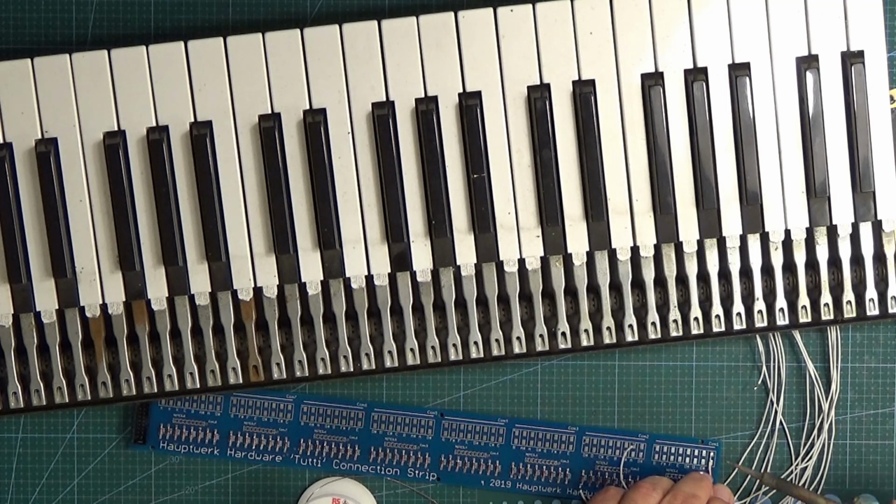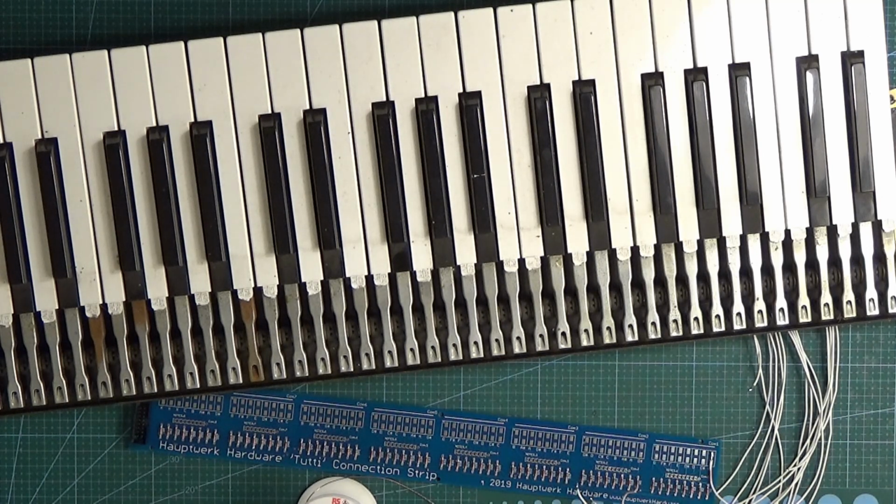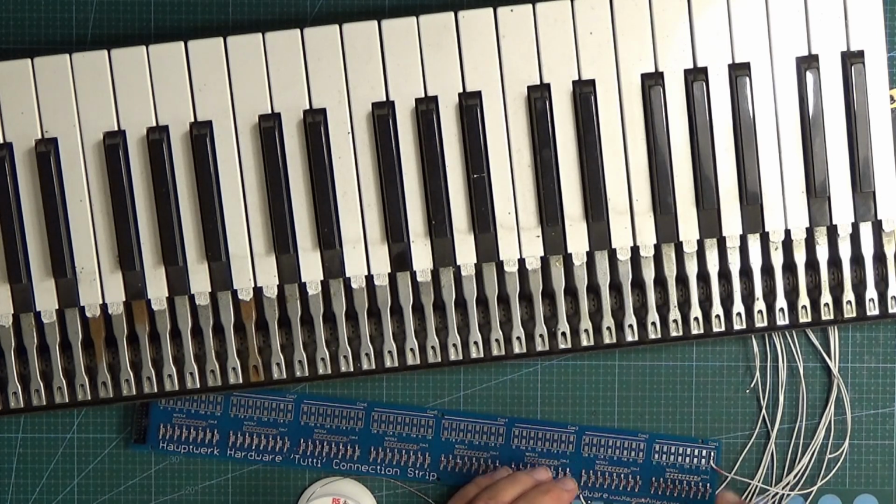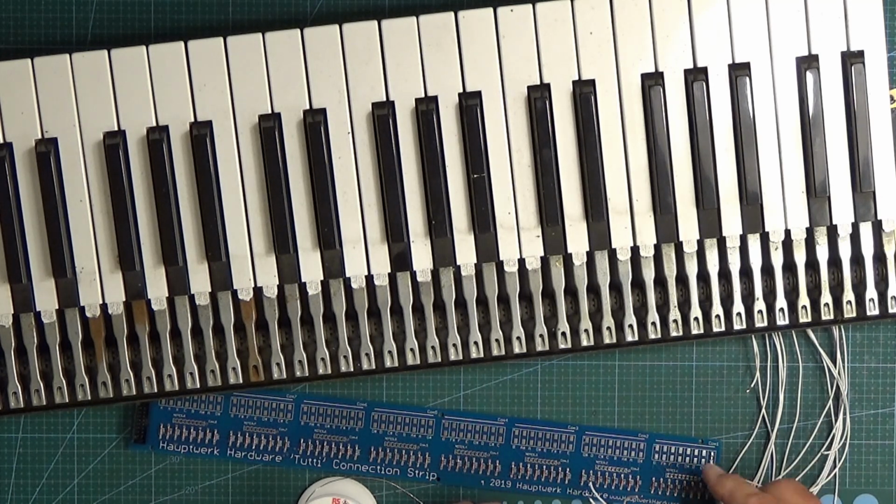I think we can see that, yes we can. So we just put the wire on top of the pad and then just touch the soldering iron to it, and that's all it takes. Okay, so it's very, very quick to put that on there. Don't leave the iron on there for ages while you fiddle around trying to get the wire in the right place, because if you do, there's a possibility of, as I say, making this pad fall off or come off of the board.